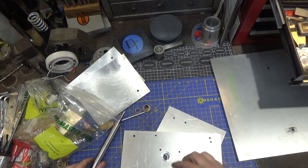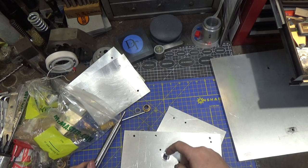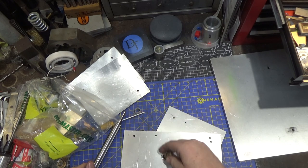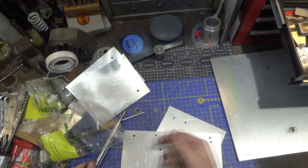But rather than jump straight to the bearings, I'm willing to do the work twice. But for bearings, I got to cut this hole out much bigger and deeper to fit the bearing in there. This is almost the right size for the bronze bushing, except the outside diameter of these, instead of fitting in a 5/8 hole, it's like 3/1000 over.